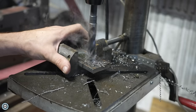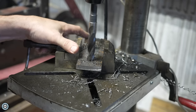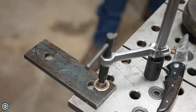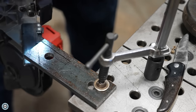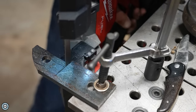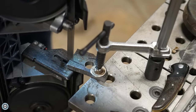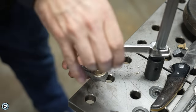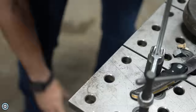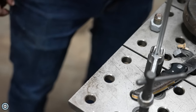You're going to want to use a better clamping method than I've got here at the drill press — people have plenty of accidents, and for some reason I thought my method was a good idea. It totally was not, and it was leaning — not a great way to drill a hole, but it got me the result I needed. Then I clamped the piece of metal to the table and used my portable bandsaw to cut the plate. If you're not already using a portable metal-cutting bandsaw, you've got to get one — this is the 18-volt compact Milwaukee version, really great, super easy, and honestly I use it more than most of my other bandsaws. Once cut, I used the die grinder to smooth out all the edges and confirm it fits over the five-eighths threaded rod.